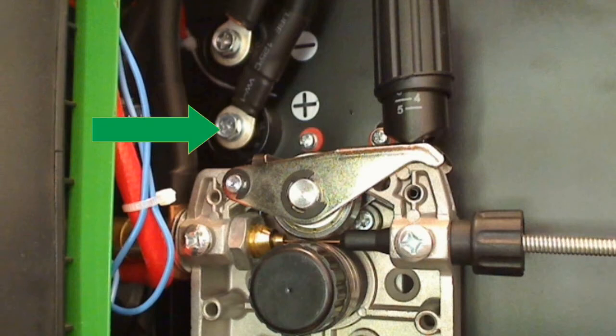At this point, it is a good idea to double check that you have selected the correct polarity for the type of wire you are using. To swap polarity, loosen the terminal screws and switch the cable positions. For MIG, the cable attached to the wire feeder should be attached to the positive terminal. For most flux-core wires, the feeder should be attached to the negative. However, check the wire manufacturer's directions in selecting the correct polarity.